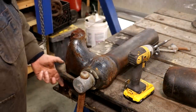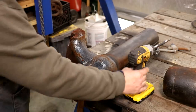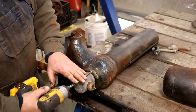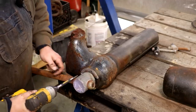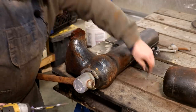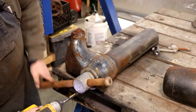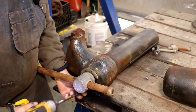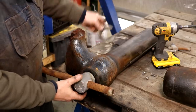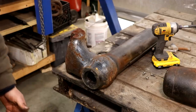I'm going to pull this little clip. There's kind of an E-clip on here that captures this screw in place. There's three Phillips head screws — I'll use my impact. Those are not in there very tight at all. Pull these out. There's another one on the bottom down here. Pull those out. This should slide up. And now the screw comes right out.